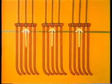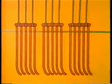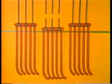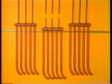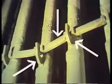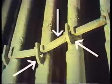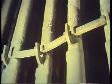Pendant and platen superheaters are suspended from the top of the boiler. Each tube element is attached to headers located outside the hot gas path. The headers have their own supports. If the header supports break, you may not be able to see the break itself, but you will notice that the superheater tubes are out of position. Another thing to look for during superheater inspection is clip and tie bar failure. Clips and tie bars hold the superheater elements in proper position in the hot gas path. Failure of clips and tie bars makes it easier for tube elements to warp out of position.